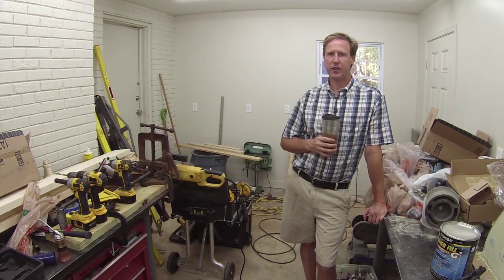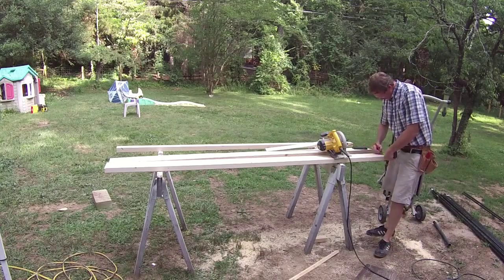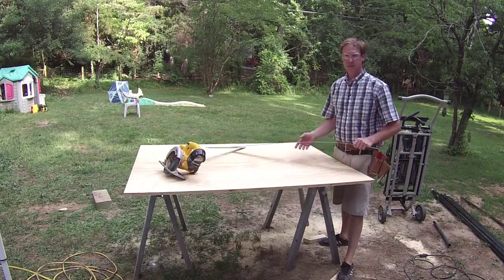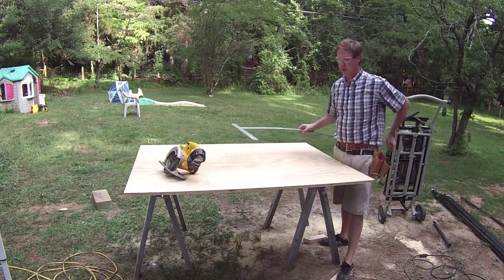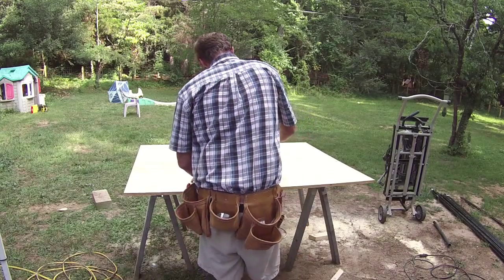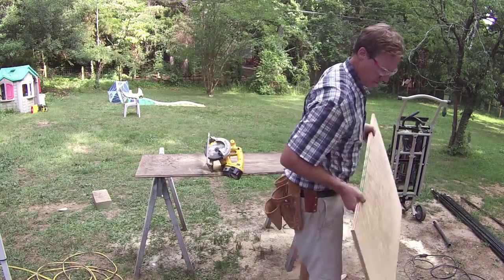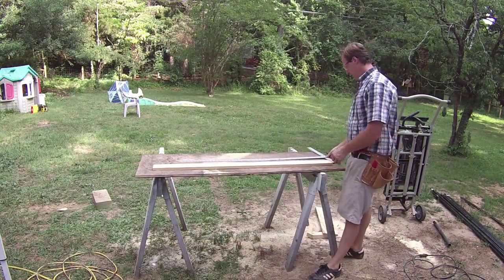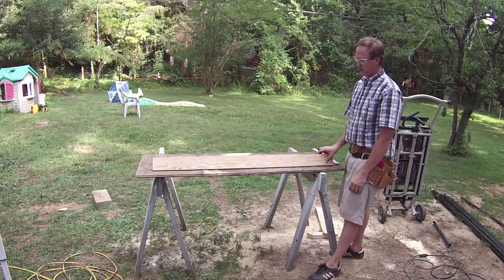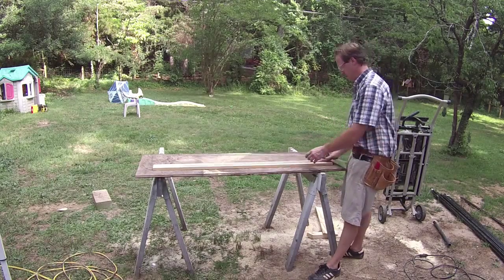Let's go ahead and start going outside. I'm going to go ahead and cut these in half. I set up the piece of plywood and we're going to cut the top — the top is going to be 32 by 42 inches. One last thing to do while we've got the sawhorses up is we're going to rip in half this piece of clear southern yellow pine, which is going to sit on the top and actually hold the plans in place.